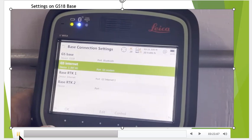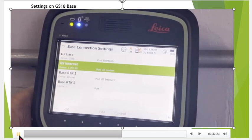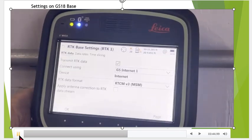So now we're in the south area. So we'll hit F4 control, and there is our APN, so01.vzw static. And that should get us on the internet. Okay. So once again, when we're on the internet, the @ sign up here, there's no triangle. If there's a solid triangle, it means we're not on the internet. And so that now means we're on the internet for the GAT27.